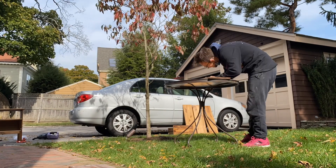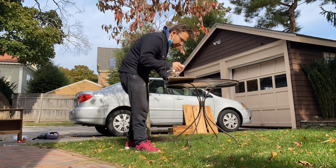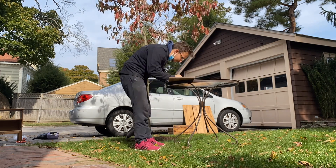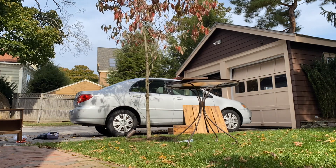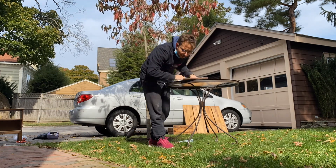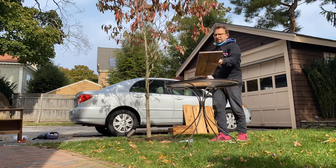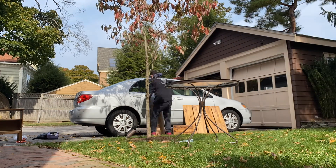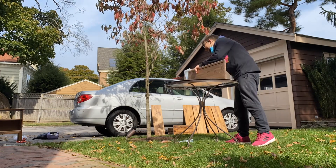Now we are on to day two. After we put one coat of stain and one coat of poly, Luba went in and sanded all of these little pieces so that we could go back and put a second coat of poly. Because the polyurethane leaves a layer of bubbles, you have to sand it down first before you put the next layer on, so that you get that really nice and glassy finish.